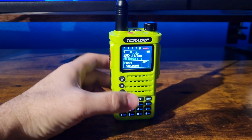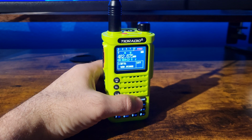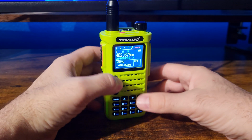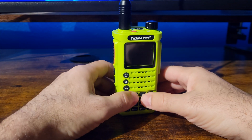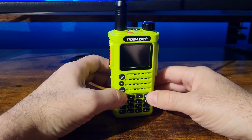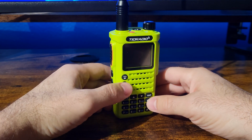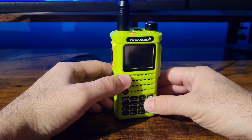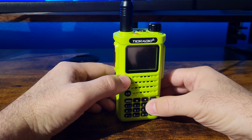So that's another thing. With the repeaters, if you want to find a repeater, basically it's a tower that someone has set up with an antenna, and it can broadcast the signal to a farther range, anywhere from 2 to 5 miles, or up to 20 or 100, depending on how powerful it is. You can connect to these repeaters to extend your reach if you want to. However, with GMRS, it's pretty powerful, anywhere from just around your neighborhood to 5 or 6 miles or more, depending. One of my friends got up on the roof of a tall building the other day that was about a mile away, and it was pretty clear.